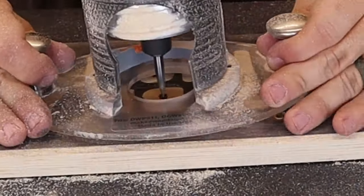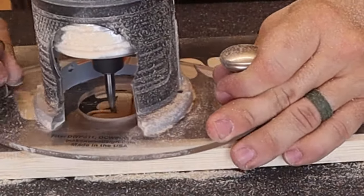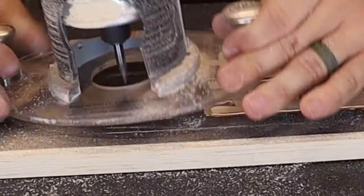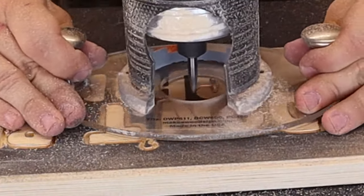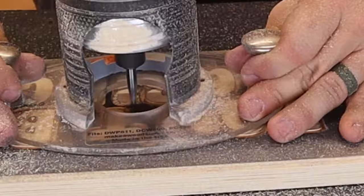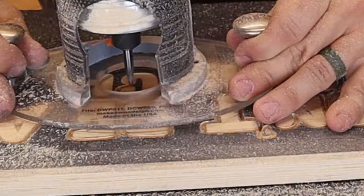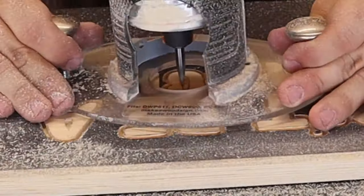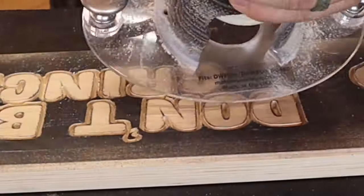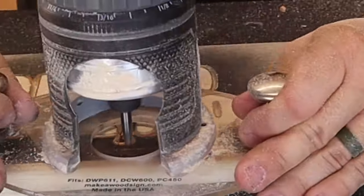One popular question we get a lot is how long do your router bits stay sharp? And there's a lot of variables in that. We're using that blue pine, which is not near as rough on the router bits as say oak or cherry or any type of hardwood really. I kind of use the general rule of 15 to 20 normal size house signs like something like this. They will stay sharper longer if you clean them in between signs, which all you really need to do is take a little brass wire brush and clean off all the residue on your router bits after you're done carving for the day. Or if you have a real long day carving, then after you're done carving each sign, that's going to extend the life of your bits a lot.